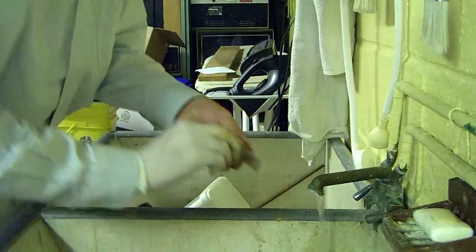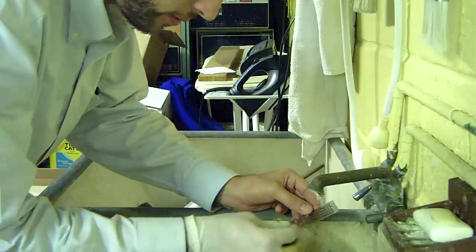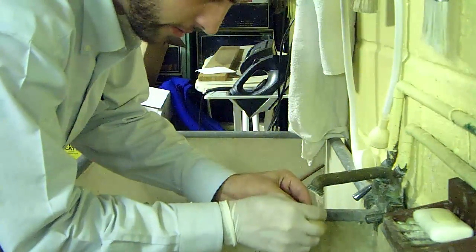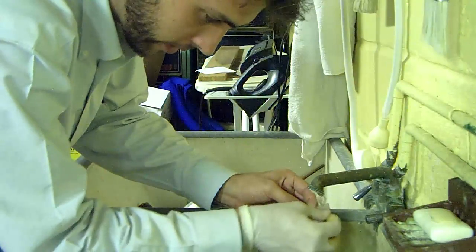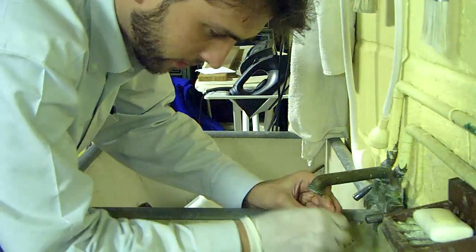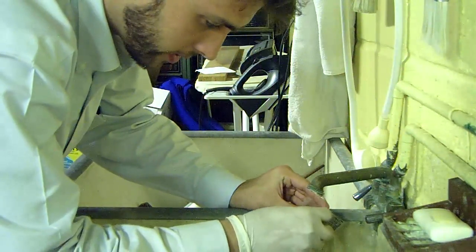I'm going to come back with a little bit of steel wool here. And you want to be very careful with steel wool not to wipe off any of the UV ink, but instead you want to be very careful just to wipe off all of the extra toner stuff. So it goes slow, and you go over every little thing. You've got to look at it manually, make sure that you didn't miss anything. Also, be careful not to touch the copper at this point in the process, because it's very difficult to get the tarnish off once you've encased it in the polyurethane. So feel free to touch the glass as much as you want. Don't touch the copper.